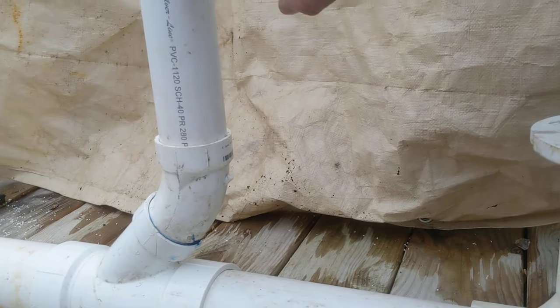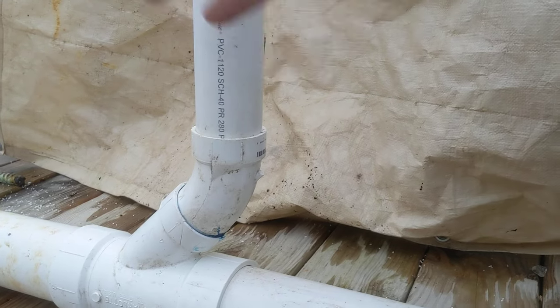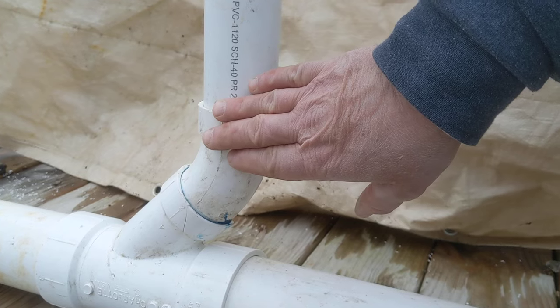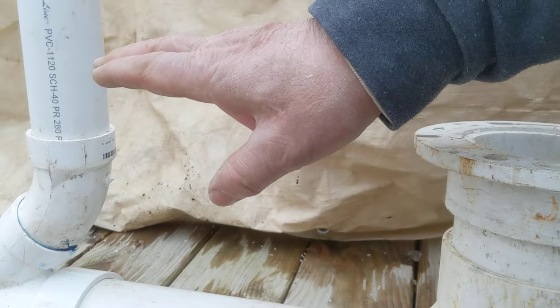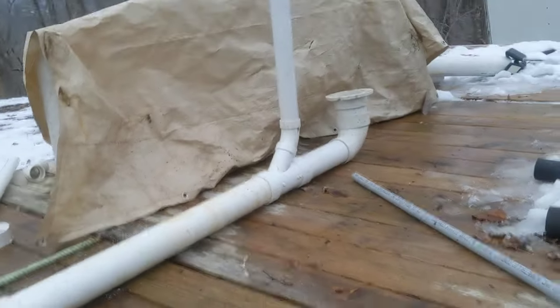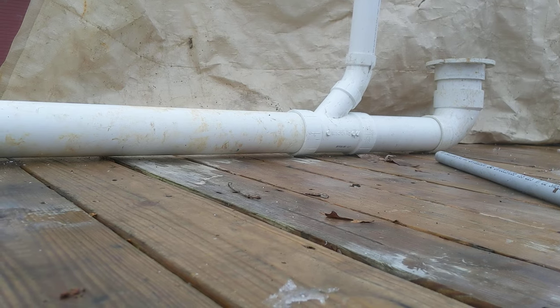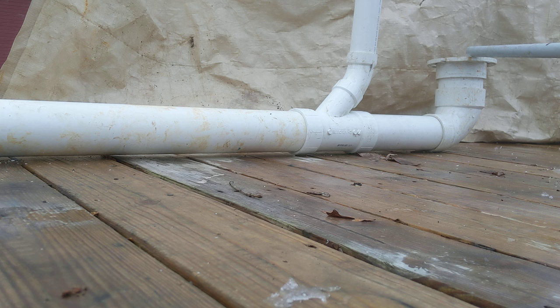So rough plumbing — we'll show you rough plumbing for your toilet. I mainly did this for the vent system. There are codes out there that'll let you put that vent anywhere you want, basically — it can be far away from the toilet. But there are some areas in the country that will make you keep this vent within six feet of the toilet.